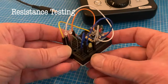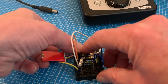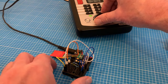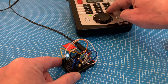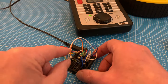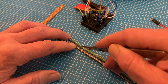I'd already anticipated that getting the right brightness for my headcode lights was going to be a challenge - they're not really headlights at all and will need to be much dimmer to be realistic, so I built myself this testing gizmo for trying out different resistor-LED combinations. Essentially what it does is mimic the operations of the DCC just in a more accessible way - the orange light for the motor and white ones for the lights, with forward and reverse rigged up to different value resistors. My job now is to find out the right resistance for my flat LED and for that I'm going to need some wires with plugs on the end - this ribbon of rainbow jumper cables will be ideal.